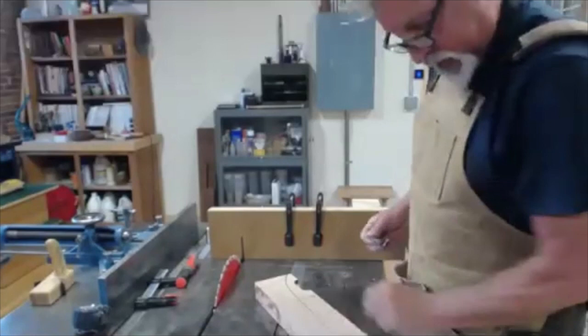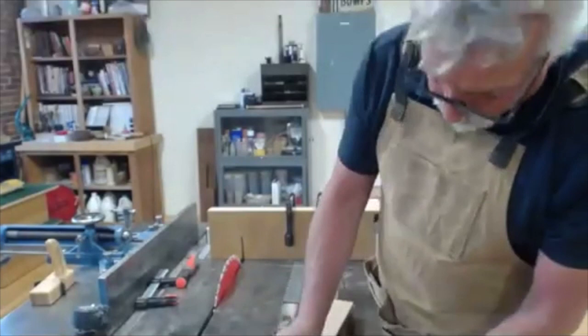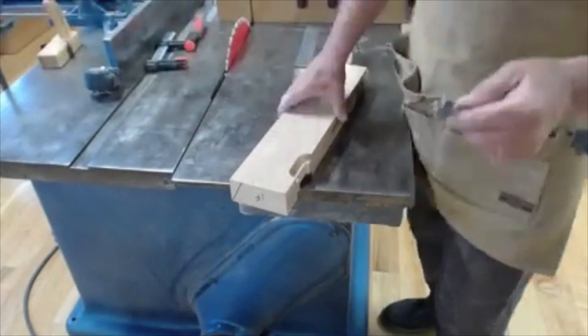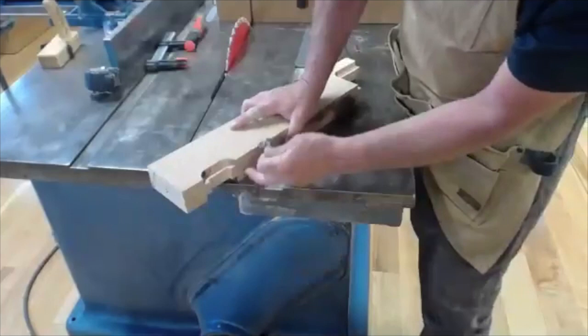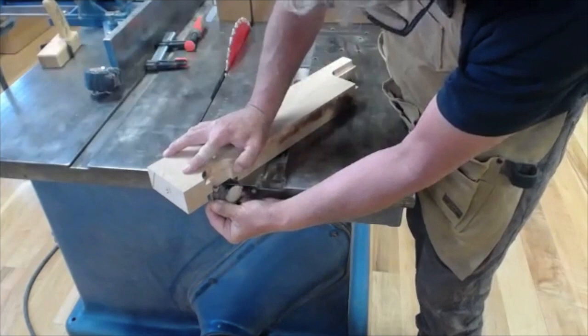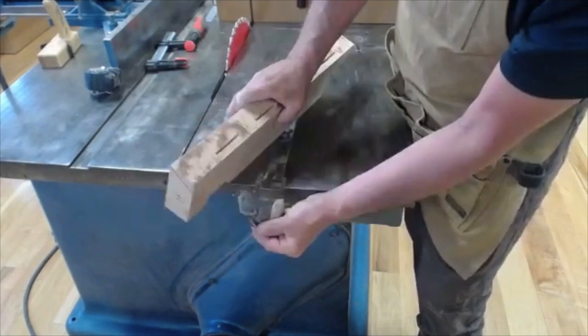When you're doing this, you have to be conscious of whether you're doing an up cut or a down cut. It's very difficult to avoid doing an upward cut. What I do, imagine that the router table is here. When I'm on a starter pin, I usually start it right here. I bring this in so that it's just shy of this shoulder right here, and I have to do an up cut to that, but it's a very small up cut. Following that, I do the downward cut into that. Flip this over, and it's just the opposite. Following that. These are much simpler.